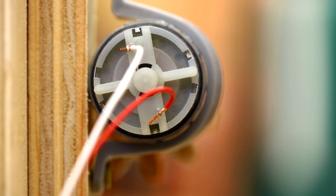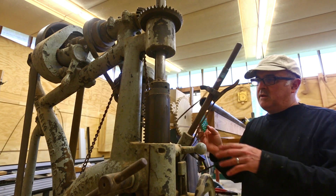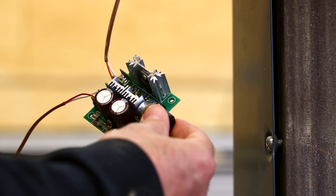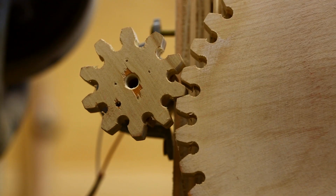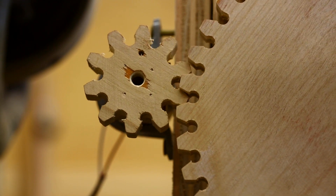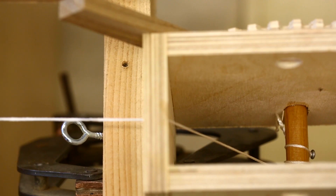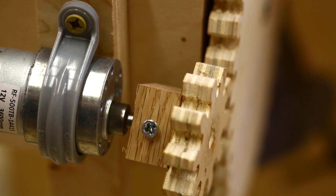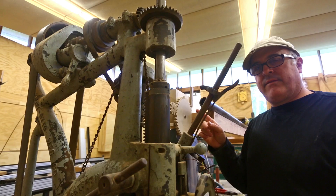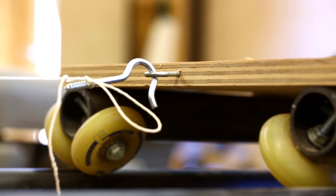What I've added is a motor and a speed control for that motor. I finally found a motor that's geared down to about three revolutions per minute, so it's a really slow motor, and I found a speed control that works with it so I can slow it down even more. When the motor turns, it turns a little gear which turns a much bigger gear, and that bigger gear winds up a string on its axle — so I'm doubly slowing down the movement, enough for the camera dolly to move seven to eight feet over about 30 minutes.